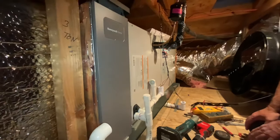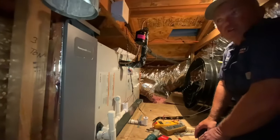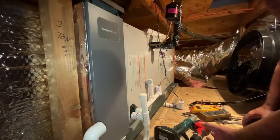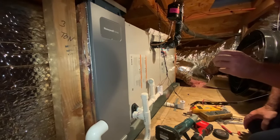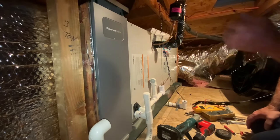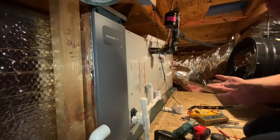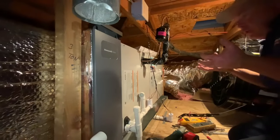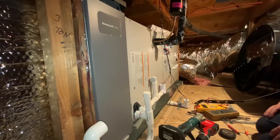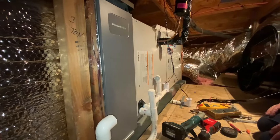What's great about these heat pumps is they're quiet and self-regulating. The colder it is outside, it'll actually pick up speed and keep the BTUs constant inside the house. Older styles were just on/off — they ran at the same speed no matter how cold it got. This one will ramp up and build heat. It adapts to the demand, whereas the old style was like flooring the gas pedal at a fixed level.